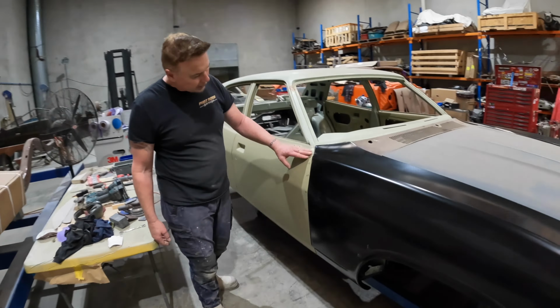So I'm going to have to double check, is that on the guard or is that on the door? But either way, I am going to open that up a bit, because we're looking here, we've only got, well, you have 5.6, 4.9, 5.1, 5.4. So up top here, I've got a 3.3 mil gap. So that's really tight through there. So I'll probably end up just cutting a bit of material off the door and evening the gap up a bit.